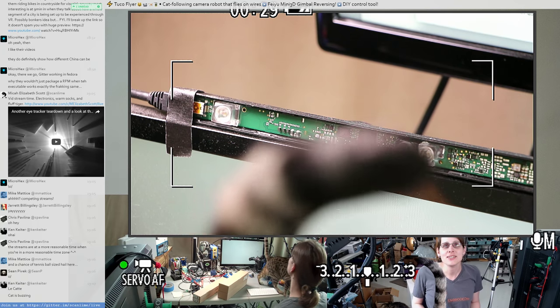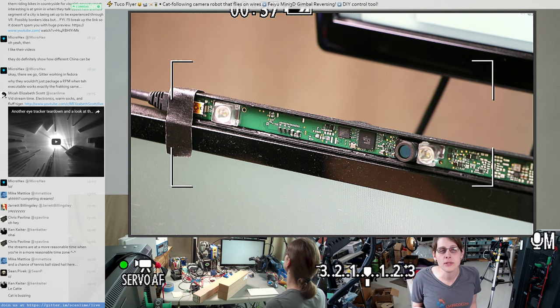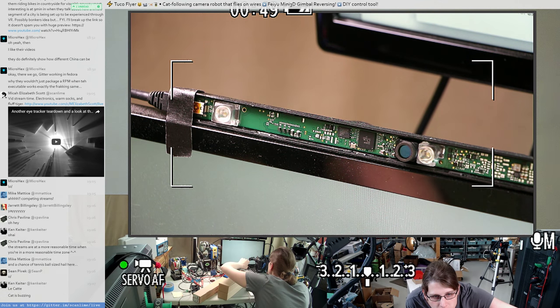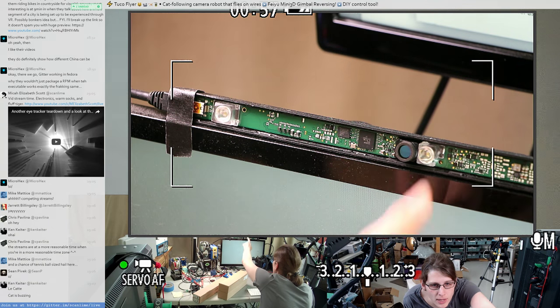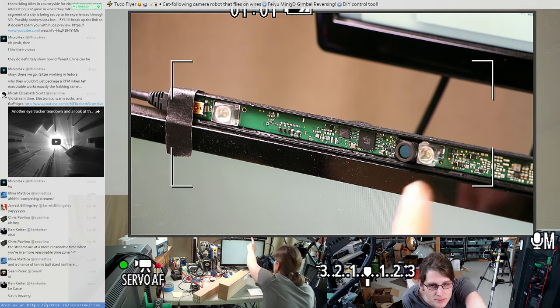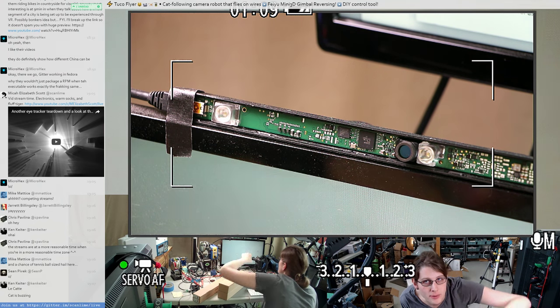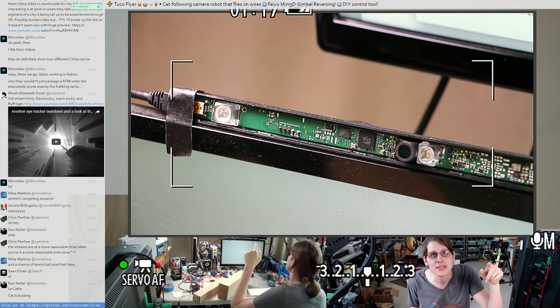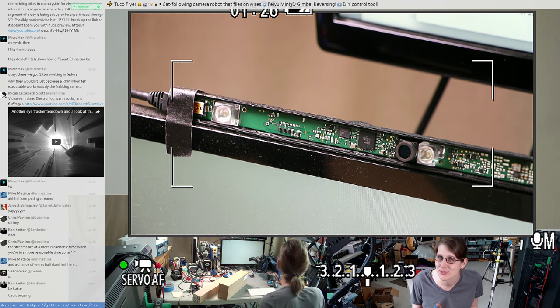All right, so you can see here the half disassembled carcass of the iX that we took apart in the last stream still. That chip in the middle, I believe, is the USB 3 microcontroller, the Cypress FX3 series, something or other. And that's some SPI flash, which I think has the firmware for that. We didn't look amazingly closely, but it looks like it's basically USB 3 microcontroller system on chip over here, imaging system on chip, power supply slash drivers for the LED emitters over here, and then some more kind of local switching power supply. And then over here is actually an interesting feature that we found, where it looks like that's an optional connector where, depending on how you populate the board, you can actually send the USB 3 super speed signal up to a flat flex connector instead of out to the really strange USB super speed mini B connector, which I've never seen before.